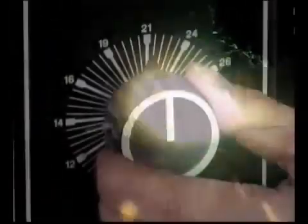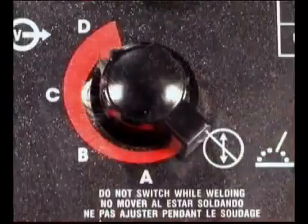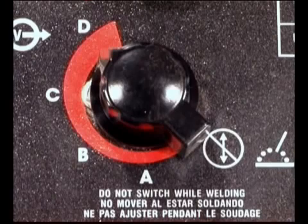Typically, voltage and wire speed parameters are fairly wide, leaving the final settings up to the individual welder depending on metal thickness, weld position, and the level of skill. Once the amount of heat and weld deposit is determined, the second part of adjusting the voltage and wire speed is tuning the arc length to provide a stable transfer of filler metal into the molten puddle. This adjustment can be made on some practice metal, adjusting either the voltage or the wire speed, as long as the dial is a rheostat and infinitely adjustable. If the dial clicks into ranges, you cannot change it during the weld.